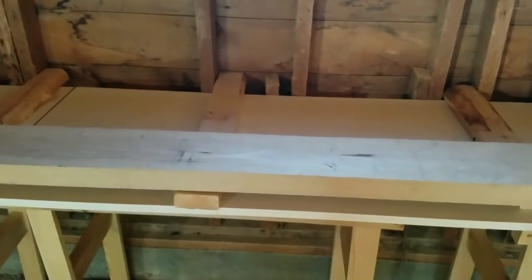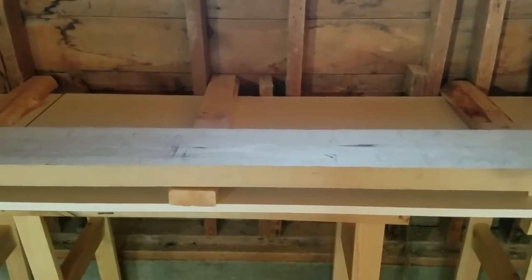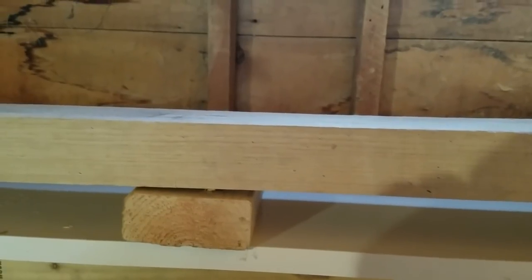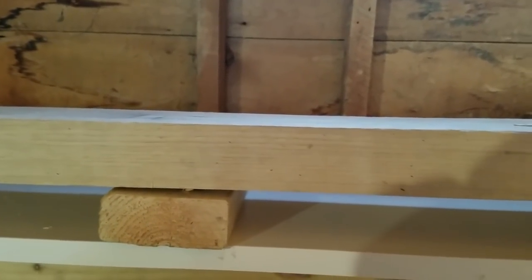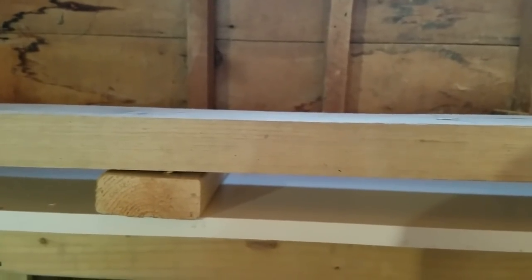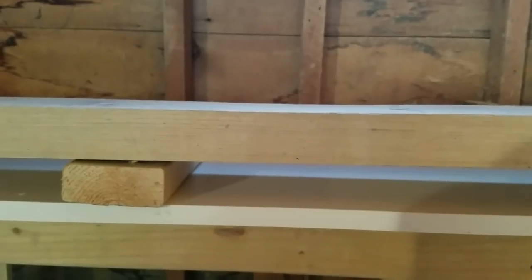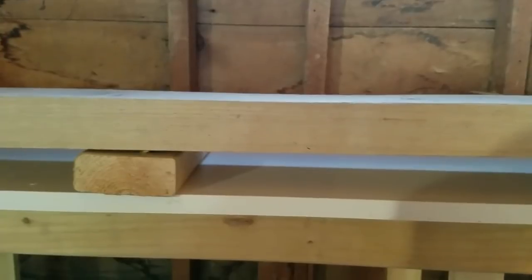It's a hickory — a very, very dense hardwood. It is kiln-dried, and as you can see in the grain here, the horizontal annual rings and medullary rays are going the correct way. So when I put this stem together and glue it up, they'll all be going the correct way, and then we'll actually cut out the very first part of the boat — we're going to start with the stem.